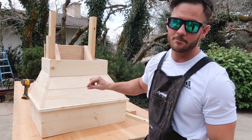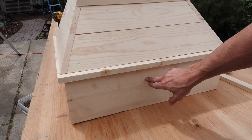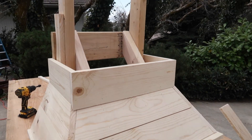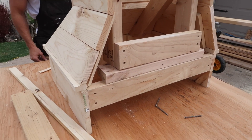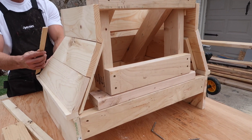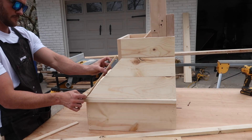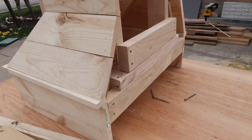I'm going to finish trimming and wrapping it, then sand it down a little bit, fill some pin nail holes with stainable wood filler, and then stain it and see how it looks. This is a one-by-eight pine, these are one-by-six pines, and then this is a one-by-two that I trimmed on the outside. We kind of jumped the gun and it's almost done before we even hit record, so we'll show you the blog like we said. He didn't use that exact tutorial but it did help him get a few ideas.